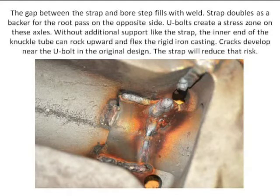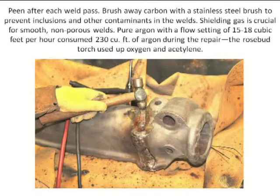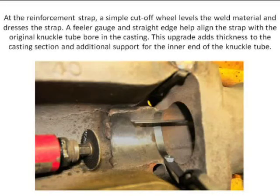Back to the TIG again — there's your process. It's just a lot of patience and pass after pass. I've done the same thing in this area, building it up. Every single pass, I want to drive that graphite into the metal. Use a stainless steel wire brush — TIG has to be spotless. Any contaminants at all and you'll get inclusions. This has to be in a clean environment. Then I use a simple air grinder and make sure it's leveled where the tube will go through the original casting and no high spots. The welds are penetrating — there's plenty of penetration. It's a very strong piece.